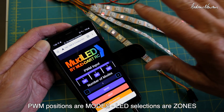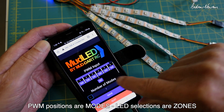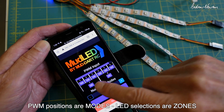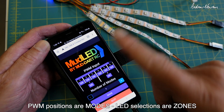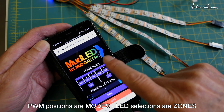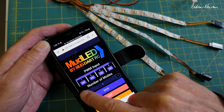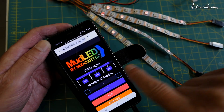You can set up different patterns for each of those zones. You can actually add more modes, going up to eight different zones — so different switch positions, different sectors on a pot, or something like that. Basically you've got eight switch positions to play with, but for now we'll stick to three.